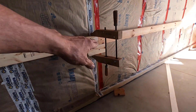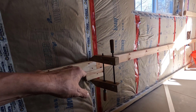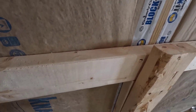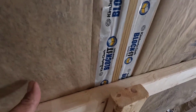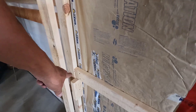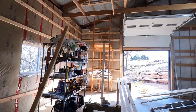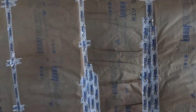On the ends, we want the next girt to be flush with the girt that came before it, so I just put a board up against it, clamped that down, put a screw in it, and then when I put the girt on it I clamped that girt down so the two girts are dead in line with each other. The catch is just a board with one screw down here and a little bit of cardboard to make it splay out, and another screw — that way you can put the girt behind it and it won't fall off. For windows, the girts extend past out to the window and you just put your block right on the line and clamp the board to the block.